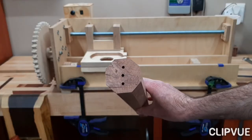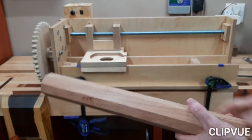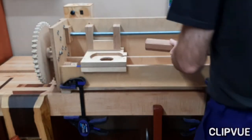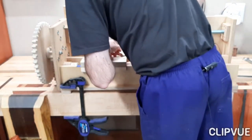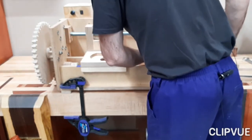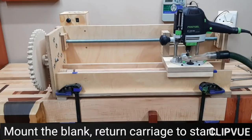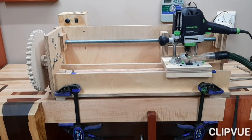I have prepared my stock off-camera. It's basically just 51 millimeter square that I turned into an octagon on the table saw. Let's get that mounted. The carriage is back at the starting position now. I'll cut this thread in three passes, progressively going a bit deeper. Just to save some time, I'll put it on a bit of a fast speed.